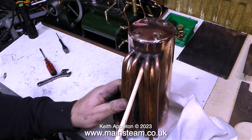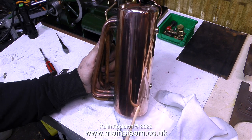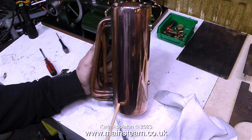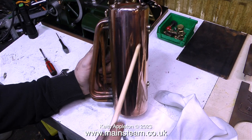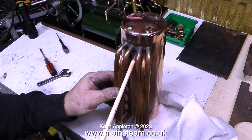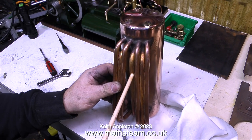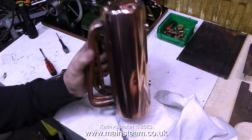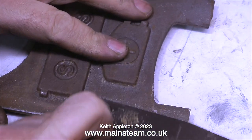One really neat feature of the 500 series of boilers is the fact that the centre tube is not a water tube — it is a superheater. All the others are water tubes. The purpose of having these external water tubes on what is basically a pot-type boiler is just to increase the surface area for heating. The superheater tube takes steam from the top of the boiler and feeds it back in — not into the main part of the boiler, but straight up to the top bush where the tap is attached. So basically the wet steam is passed through the fire before it comes out of the tap.